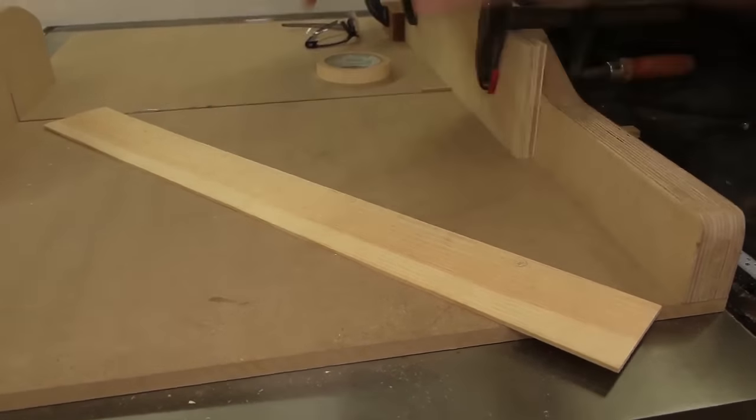So even though it's solid, because it's quarter sawn and white pine, you've got the most, as he describes it, well-behaved wood in this country. It moves the least with seasonal movement of any softwood or hardwood. If you have the quarter sawn version, you're getting even less movement across there. So if you have a board wide enough, this is interesting. It looks like he had a solid board, beautiful quarter sawn on that bottom there. Beautiful choice of material right there.